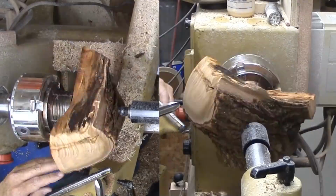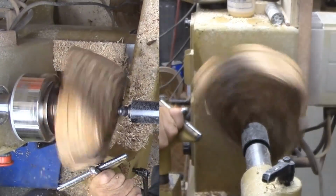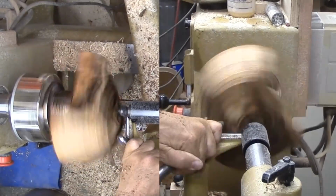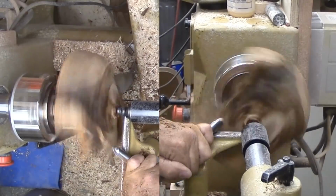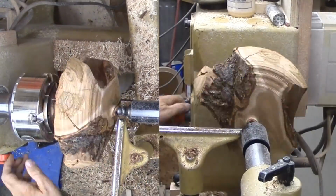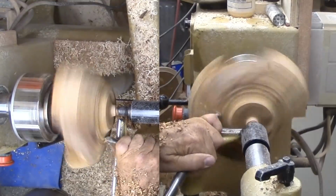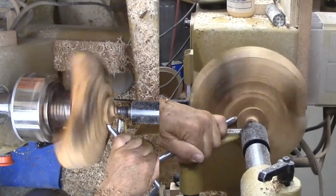It is extremely important to spin the wood before turning on the lathe. I also have to maintain absolute focus on my tool as I present it to the wood. There is no way I could hog out the wood. Only gradual cuts can be presented. With the cracks in the wood, I have to keep my face out of the zone of danger. Bark flies off. More bark flies off. A big piece of wood at that big crack flies off. I decide to keep going.